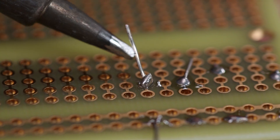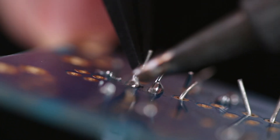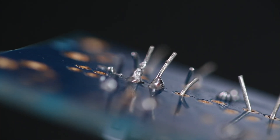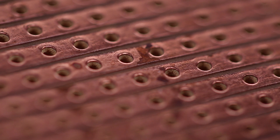If the surface appears rough and bulging excessively, we may have what's called a cold solder joint. These occur when solder hasn't fully fused to each surface, making the electrical connection unreliable. Cold solder joints can be caused by a lack of heat distribution, some motion during soldering, or a coating on the metal surfaces.